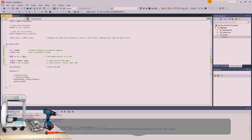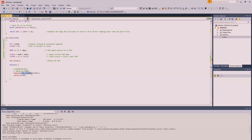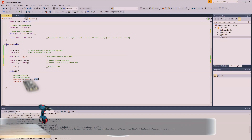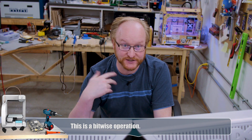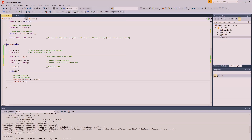We call set speed with the result of ADC read on ADC 5. It's a function within a function - we call set speed and give it the result of ADC read, AND-ed with 0xFF. The reason we do that is because there are two bytes combined into a 16-bit value for the ADC, but our PWM timer only goes from zero to 255. So I don't want extraneous bits in it - I'm ANDing the 10-bit value with an 8-bit mask so we only have an eight-bit value, then we delay and do it all over again.